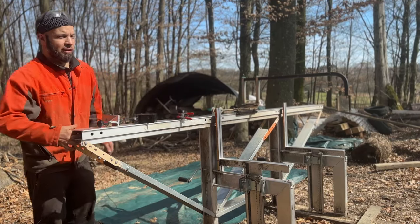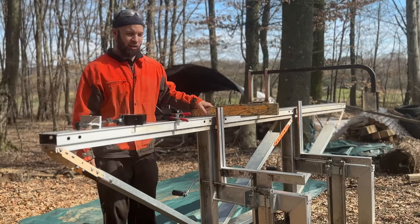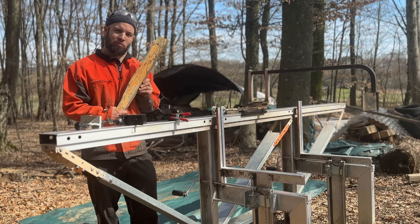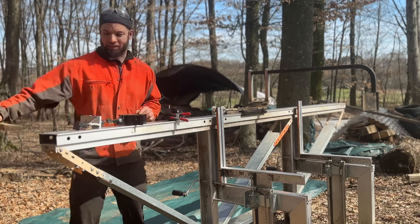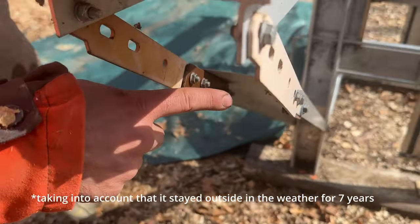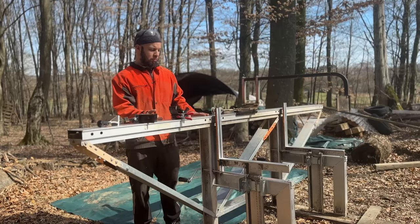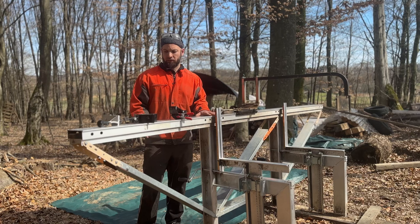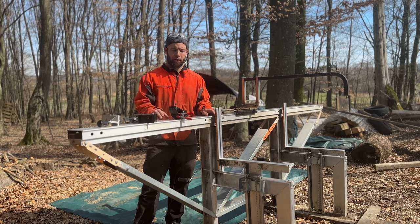You will need other tools a lot of the time. Like here I have this thing that tells you how high the cut is on the other side — everybody has one of these and it stays with you for a lifetime. After a while some of the holders were breaking and I had to repair pretty much all of the connections — I put some steel plates, drilled them, and bolted it again. It wasn't a big deal, and that's the great thing about this sawmill: it's quite simple and you can do your own repairs without being a mechanic. I think the new iteration is actually much better with these connectors and I don't think they break anymore.